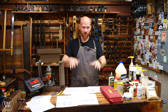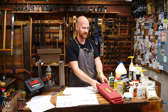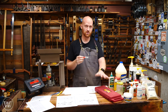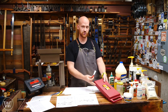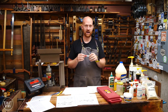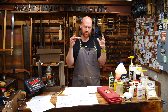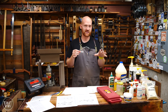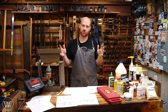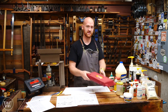If you want to see any of this data, all of it is down in the sheets below. The biggest surprise to me is how strong the 2P10 and cyanoacrylate glues are — and particularly the cheap super glue. In most instances, the cheap super glue is right up there with the thick and gel 2P10, doing really, really well. The thin 2P10 I was not as happy with — I think it just absorbs too much into the wood and doesn't hold as well. But for the thick and gel, it is a really, really good glue and I'm going to be using it more often.